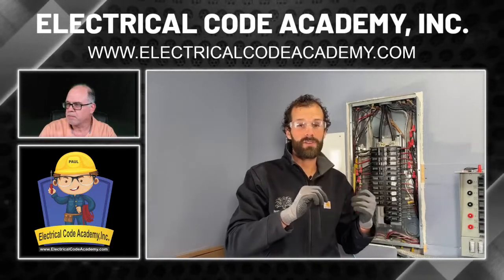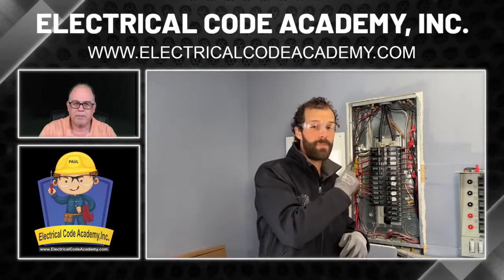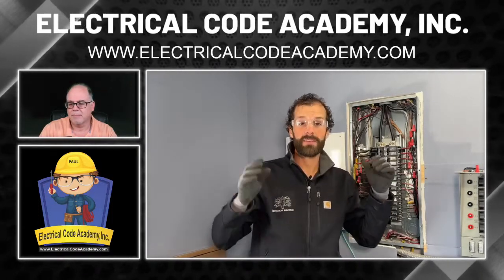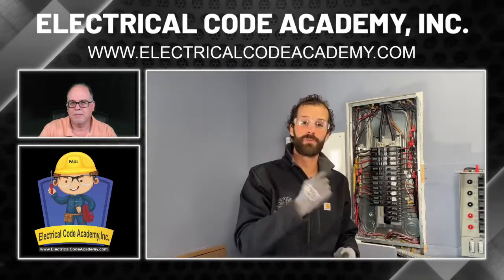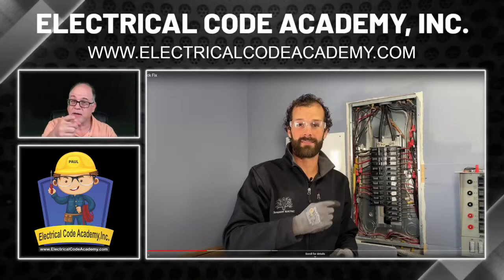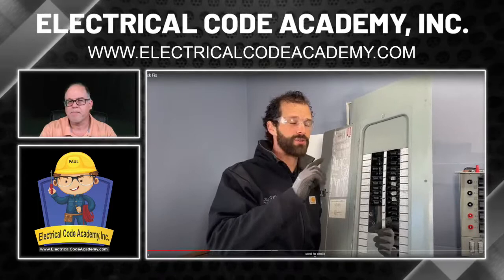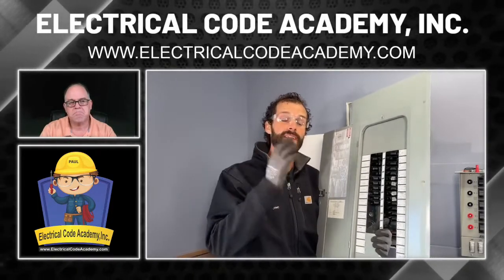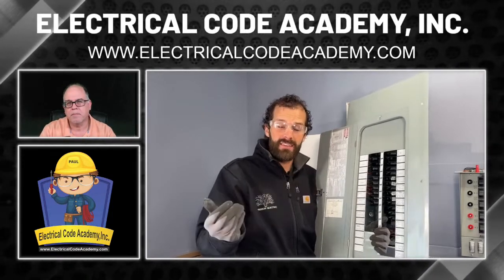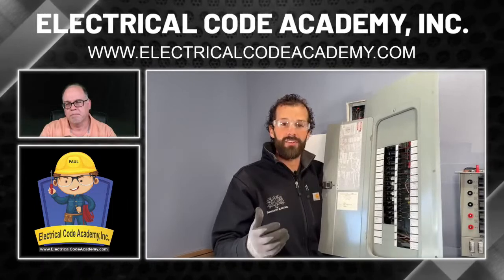First, let's go over assessing our situation. A lot of electrical panels are not labeled or are incorrectly labeled. We're going to go over your three options for combining circuits — this depends on the brand of panel you have, and some of this even pros don't know. My go-to for combining circuits is lighting loads. Old incandescent lighting loads were ten times heavier than modern LED loads, so LED lighting circuits are the first key when looking for lightly loaded circuits to bring together.